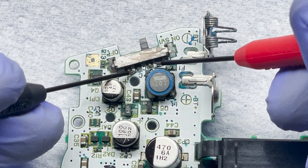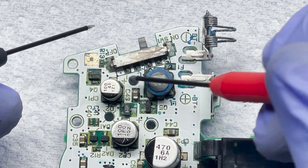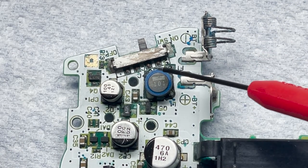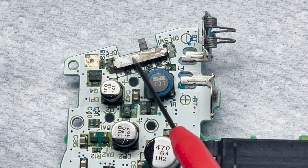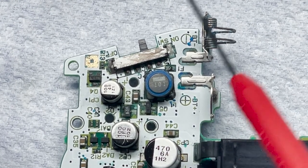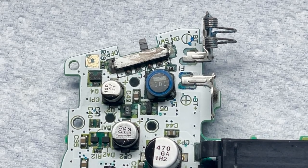The common works and these two are working, but the on position doesn't work. So I think what I'm gonna do is reflow this and see if that helps. If it doesn't, I'm probably gonna have to grab another board to see if we can fix that one — I think it has the same issue. Let's go ahead and try to fix this one real quick by reflowing it, because I'm gonna have to wait for a part to come in. I don't have a spare for this one. So let's go ahead and do that and see if it fixes it.